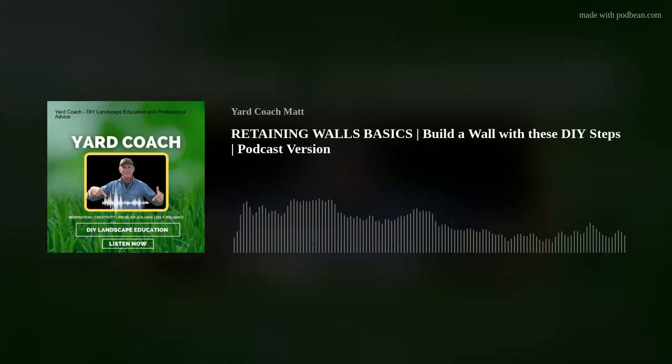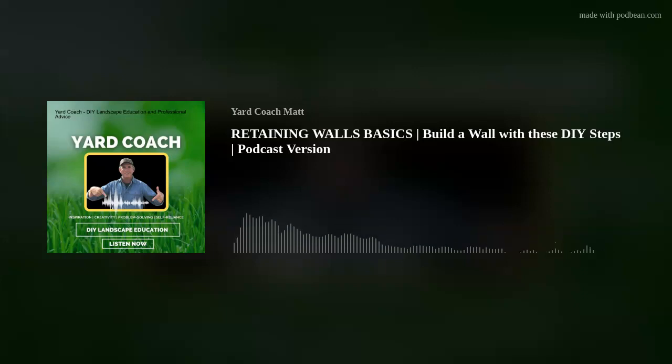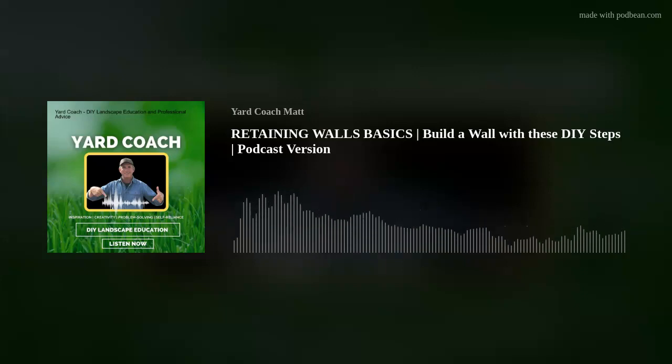This is something I really want to emphasize. This base layer and this first stone is something where you have to achieve perfection. This is not where it's good enough or pretty good. No, we set it perfectly level. And once that block is set, then the whole course of the project stretches out from that block. You set the next block next to it, you repeat the process. Front to back, side to side, and block to block now. They have to be perfectly level.